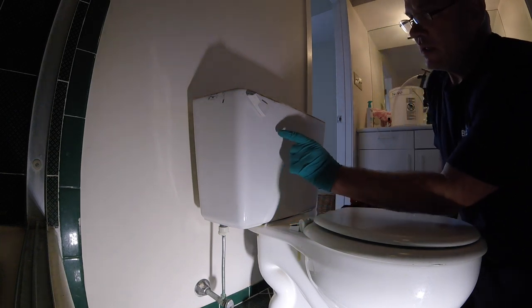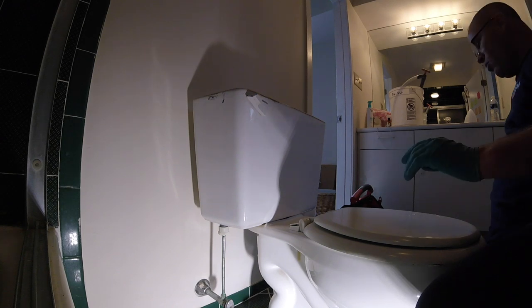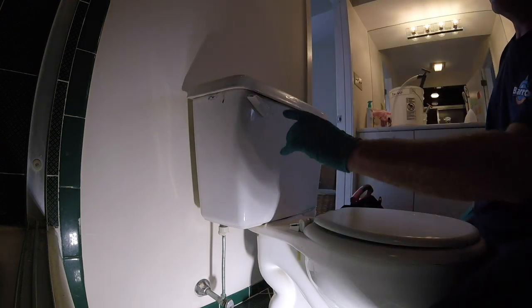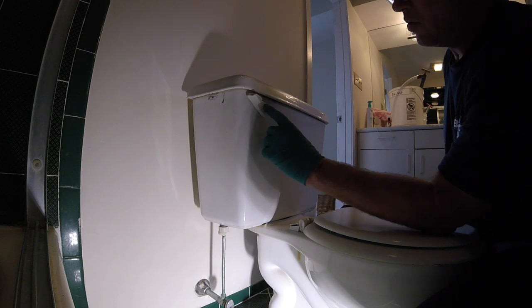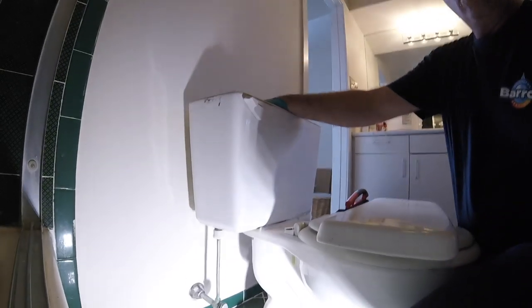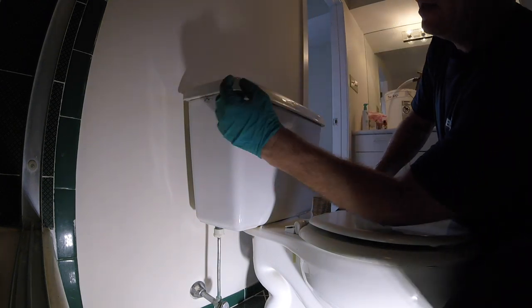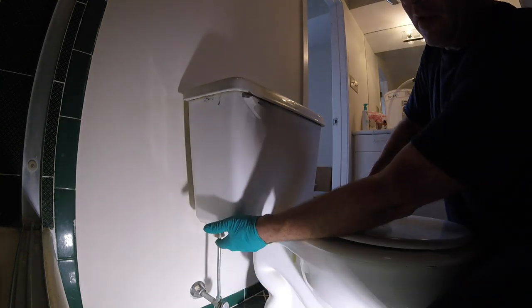You can also have a stain right here at the swivel handle. On a flush toilet, you can walk up on the job and when they flush the toilet, water comes out here — that means the toilet is filling up too high and the fill valve could be squirting up, or squirting directly into the handle hole, creating a leak on the floor. I've actually had toilet lids where water hits the lid, comes on the outside of the tank, and leaks on the floor, simulating a bad tank bolt leak — but it's actually the fill valve.